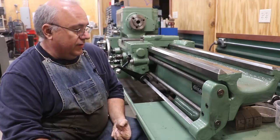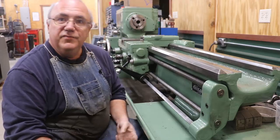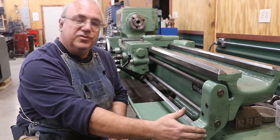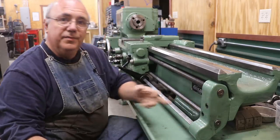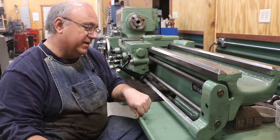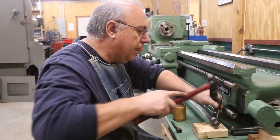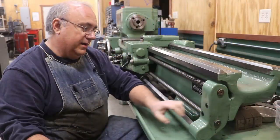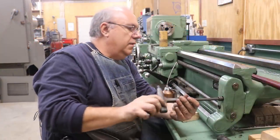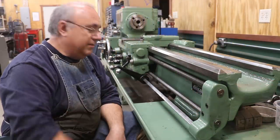I lost a little bit of audio, so I'll just tell you what we did. If you look down here on this end of the machine, we had to put this little support block on — it's a casting that goes up on here with three holes, one for each rod, and there are just some bronze bushings up inside that allow them to rotate on the square rod. Just like with the other ones, we've got a little adapter that has the three-quarter-inch square hole in it and takes it to round so it can rotate in there. A couple of bolts hold it in place.